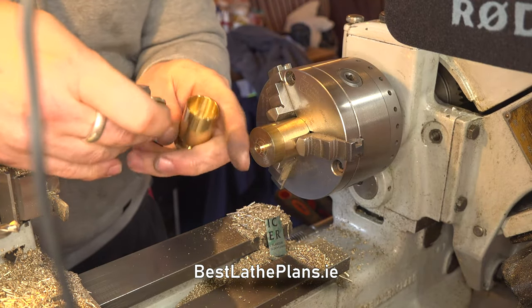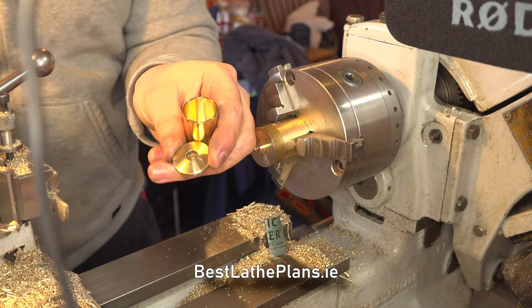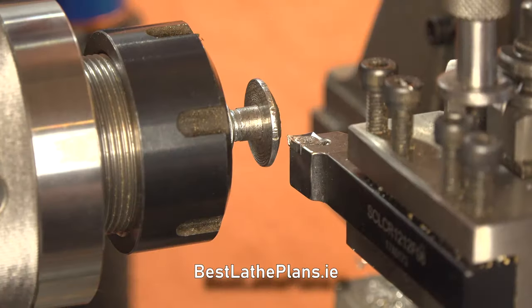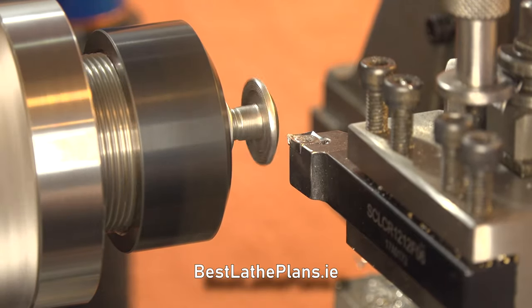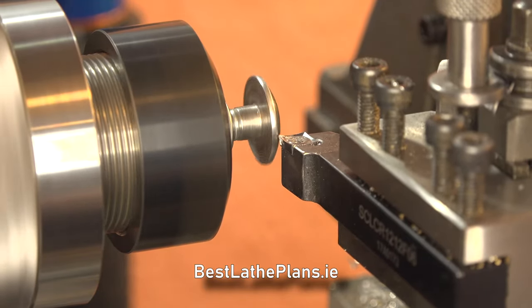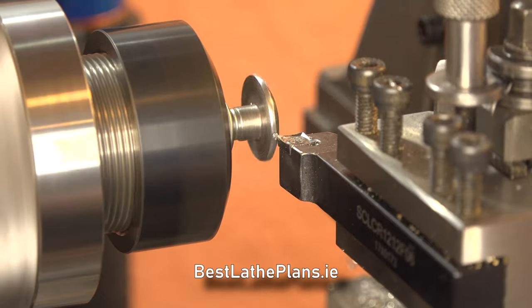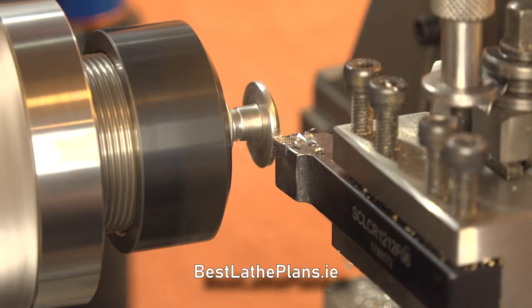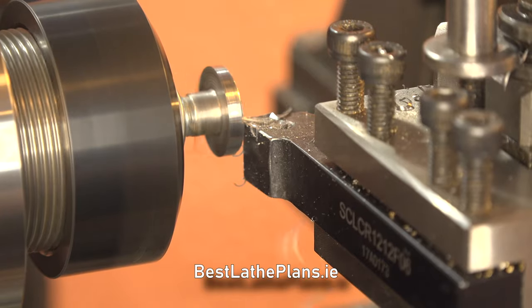Next we need to make the holes through the tapered part of the lid. Because this is an awkward couple of steps I'm using the vertical milling attachment, but first I need to reduce the head of an M8 bolt because the jig I'm using has the bolt head getting in the way of the cutter. The jig is a simple M8 hole cut into a piece of scrap stock, and the lid is clamped in place using the bolt.